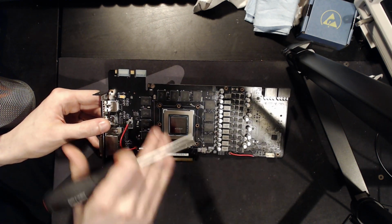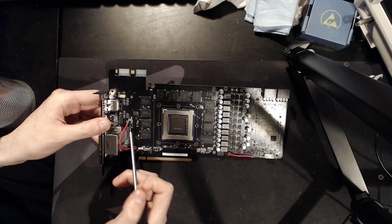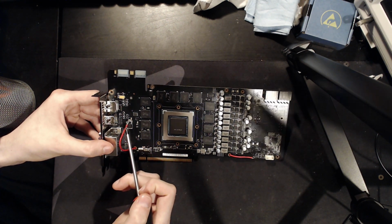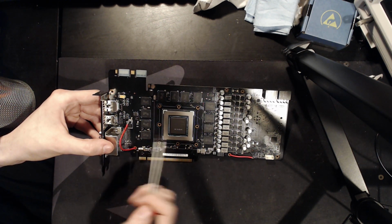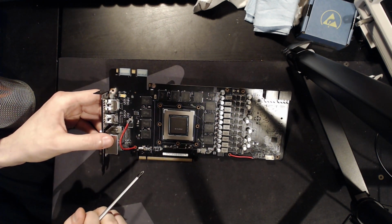So the board has to create its own 5 volts somewhere. And the obvious suspect is this big thing, because that's a typical LDO package, especially for a higher power LDO. This is a really popular package. So is this a 5 volt LDO? Turns out that with the card running, I stabbed it with a multimeter, and yep, that does spit out 5 volts.